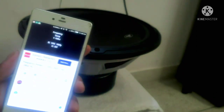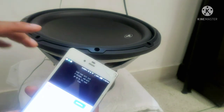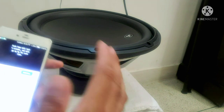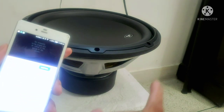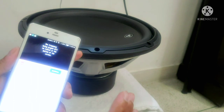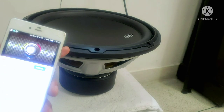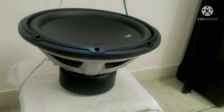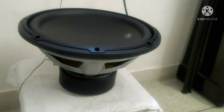Now it will start in a few seconds. I'm going to do this for the first time and we'll see what the response is — we haven't heard it yet because it's not in an enclosure. Are you guys ready? Here we go. This is going to start at 1 Hz. At 1 Hz I can't see any different movement. But at 5 Hz guys, check it out — it is moving. Now it's on 10 Hz guys, check out the flex, the excursion!